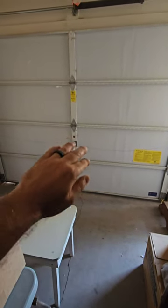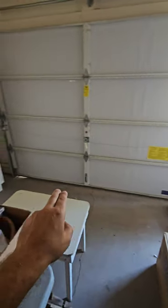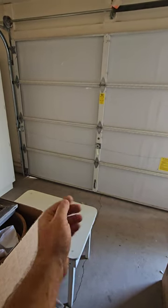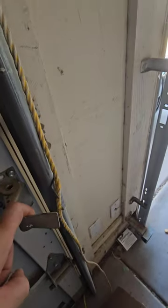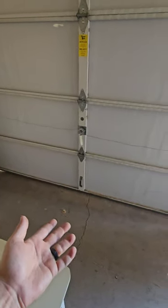With the garage door all the way down you can see openings on the sides — not so much over here, but you can over there because it's heaved up a little bit. Now we've got a gap over there and I can't close this garage door — I can't get it down far enough to latch it. You're going to need some repairs to the garage door, and if you're not going to fix the concrete slab, the garage door isn't going to close.